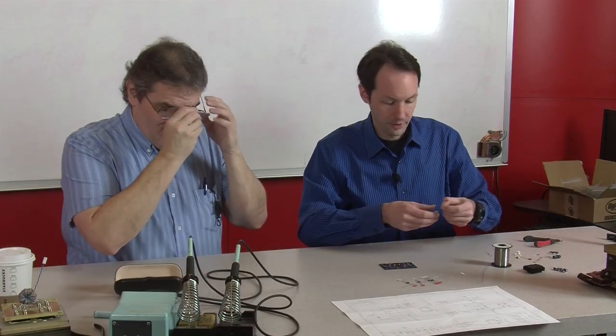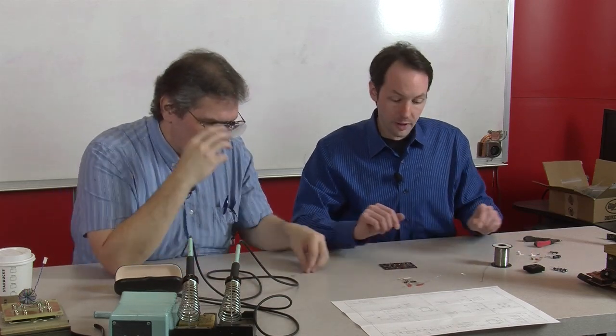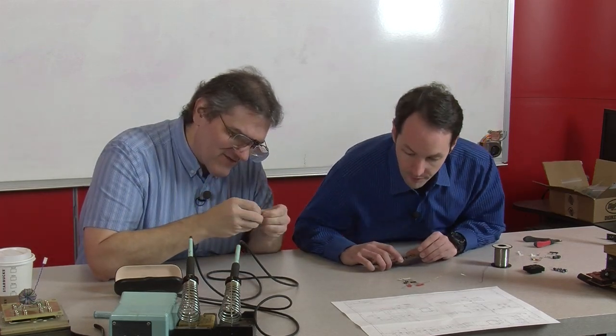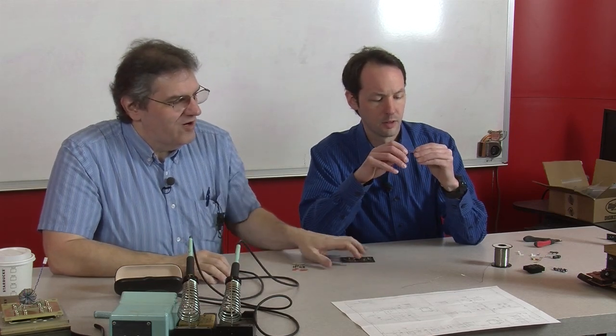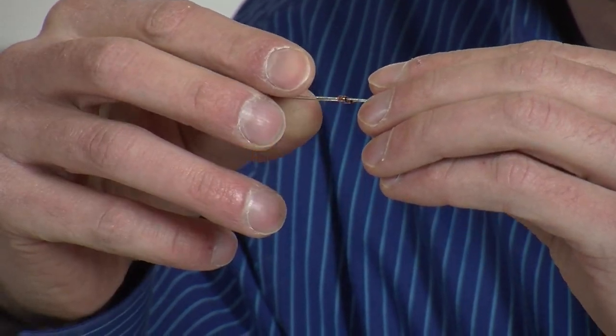And zeners. The zeners are the tiniest, so let's do those first. And there's actually a number written on there. It's a glass zener. I can't really read it, but I'll let you see if you can see it. The number will be 1N, and then on a second row, the rest of the number. 08. 23.